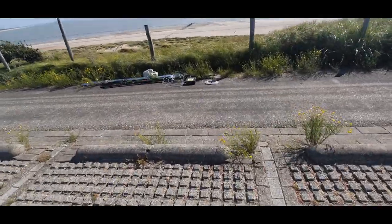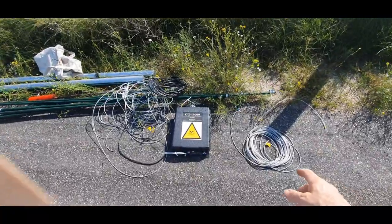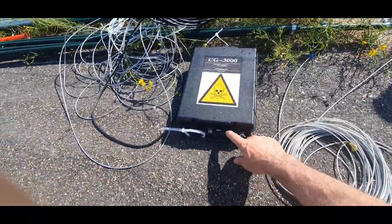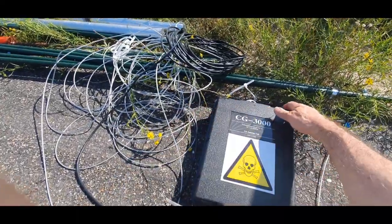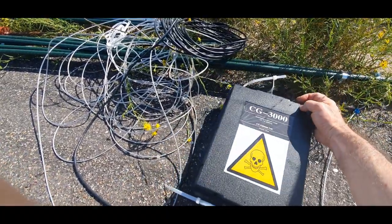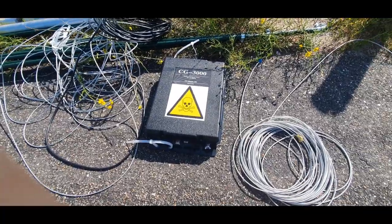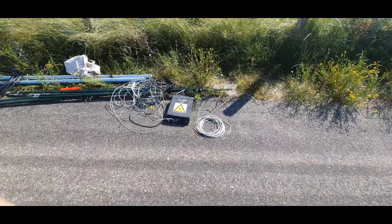but today, to try something a bit different, we have a 20 meter line on this side which is going to go to the earth terminal, and we have another 20 meter line that's going to go on the top, one going right, one going left. So it's going to be a 20 meter dipole today. Hope it makes some difference. We'll do all that in a minute.